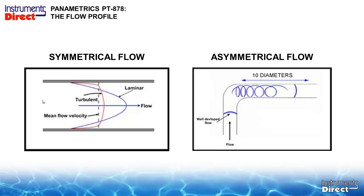The picture to the right shows an asymmetrical flow profile — what happens when you don't have enough straight pipe. Flow going around an elbow creates a shorter distance on the inside and longer on the outside. The flow will tumble inside the pipe, and right after the elbow you get a lot of disruption. If you put your ultrasonic transit time meter right there, you probably wouldn't get a good flow rate — you'd likely get a fault condition and no reading at all. You need to move downstream 10 pipe diameters to where it looks like a symmetrical flow profile.